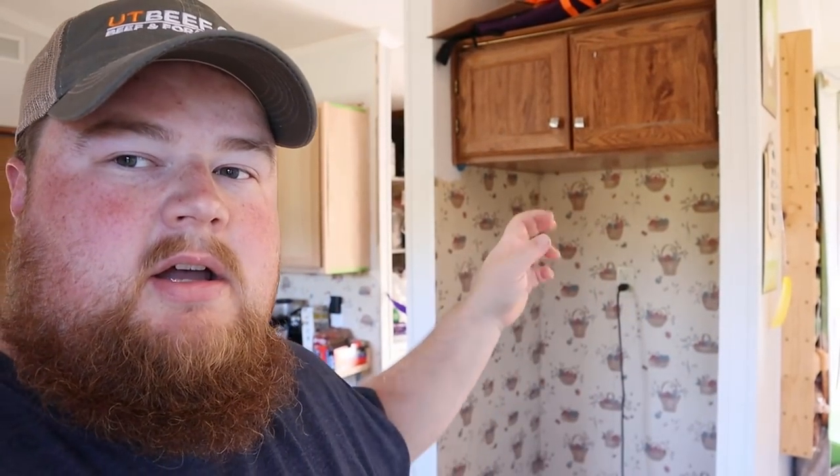So I have to be really careful as I'm cutting the floor right here, because this wall is where our main electrical sub panel is for the home. And there's a hole in the floor, looks like a drilled hole, so I've been kind of watching it. I just got a flashlight and realized it's really good. It was a blessing that I was being extra cautious, because there's some high voltage wires for our stove and looks like our furnace running really close to where I would have trimmed the floor next to the wall.